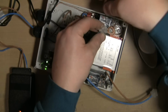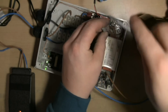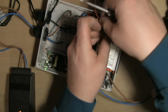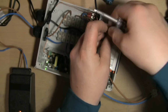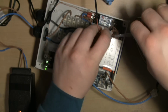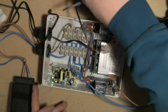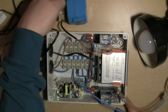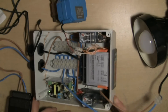motorised valve. And I did notice that it's open if you put the positive connection to the red wire. So there we go. That's just going to close for a moment. So that's closed because as far as this unit thinks now, we're at temperature. We're at 22.1 degrees. You can't see it, but we are.